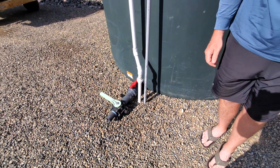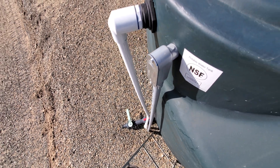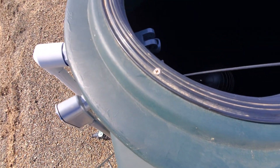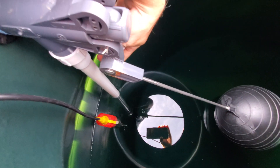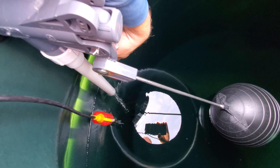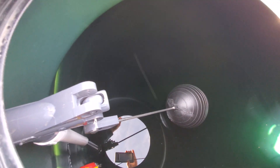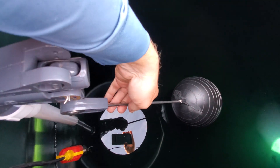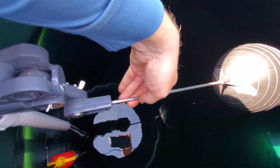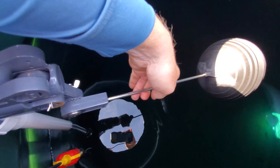Let's take a look inside the top of the tank. Water comes into this little pipe stub — as it's filling it comes along out of this pipe. Since we have a constant pressure submersible pump down in the well, we elected to use this float valve. It's basically like a big toilet valve — once it gets full at about 2,500 gallons, this fills up and shuts off the flow.